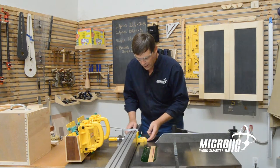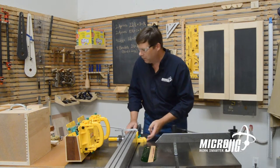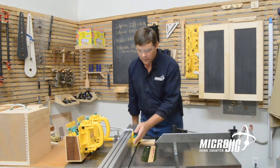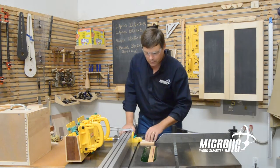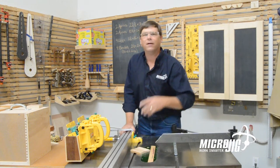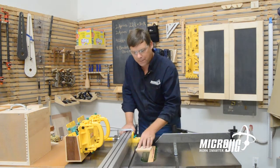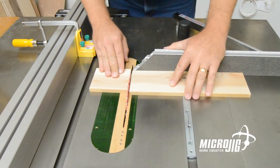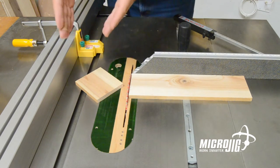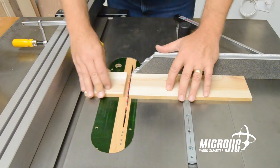The second is that with three inches from the rip fence to the blade — the marking point — once I have three inches in there, instead of just the three quarters we have with the scrap block, my block can actually fall off and turn fully 45 degrees and it's not going to catch on the blade. So it's safer because it's farther away; it gives that part more room to twist. When the part separates, it can twist 45 degrees and it's never going to come into contact with the blade and come kicking back out at me.